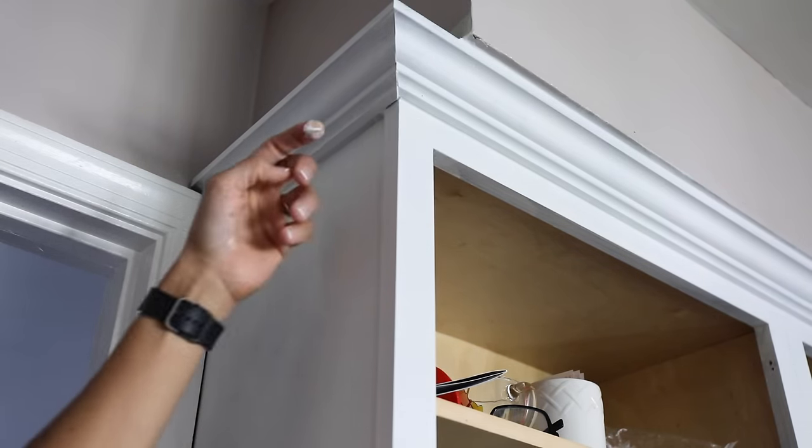I was a little nervous about hanging everything back up because I had kind of lost track of which cabinets go where, so I just had to figure out where each one probably goes. You notice that by taking the cabinets off and painting them, the hardware just looks so much better. If you're thinking of doing this project, don't be lazy — take the cabinets off. When putting things back, the cabinets could be crooked and you'll need to make adjustments. There are three points where you can move it side to side, up and down, and in and out — making those three adjustments with a screwdriver will allow you to properly align your cabinets. I reused the same silver hardware because that's less money, and it doesn't have to be super modern — it just has to be clean and work.